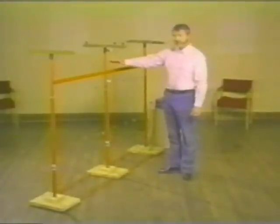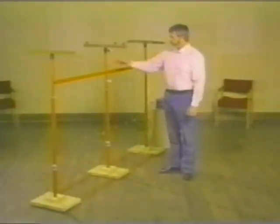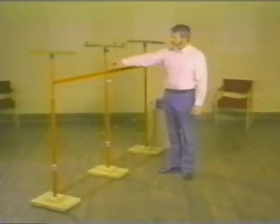The simulator unit is made of epoxy glass. Epoxy glass has a 100,000 volt per foot dielectric value. There are no poles in the field that have that. If there were, it would solve a lot of problems for you. But because the unit is made of epoxy glass, we use these wires to represent the pole.